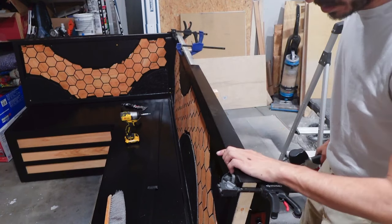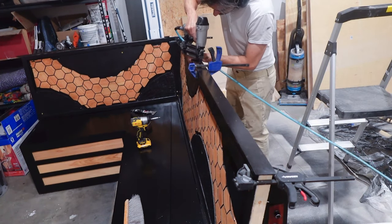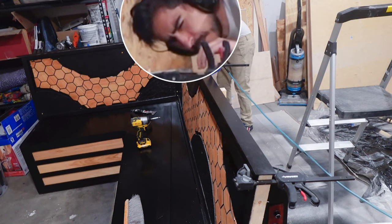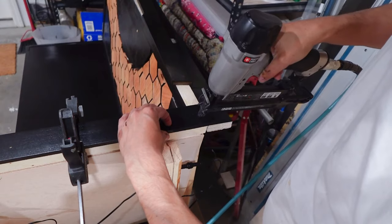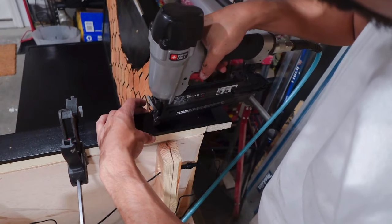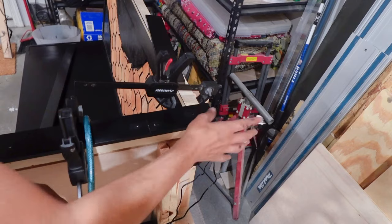After staging the two backrests in place, I added some half-inch thick boards and brad-nailed them in place to give a thicker look and cover up any outer profiles of the plywood. These boards were made out of the same cherry I used for the hexagons, just painted black. I filled in the nail holes with spackle and touched up with paint.